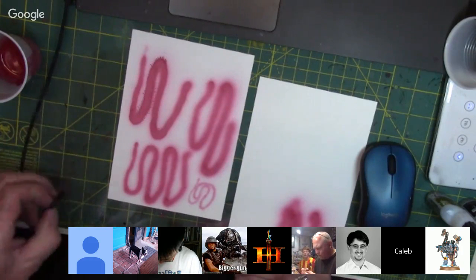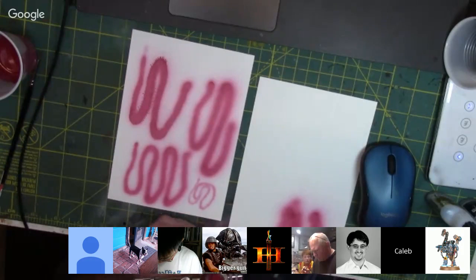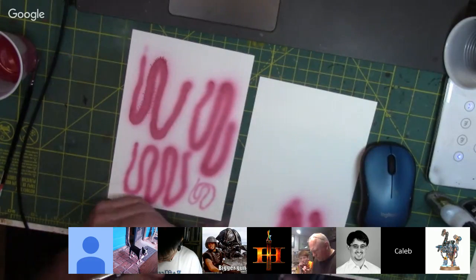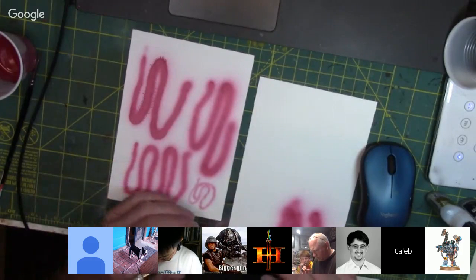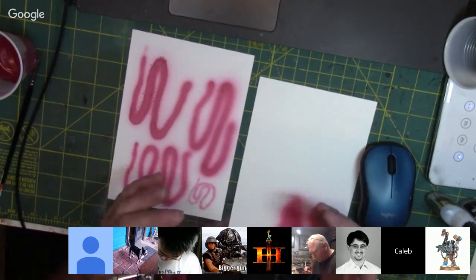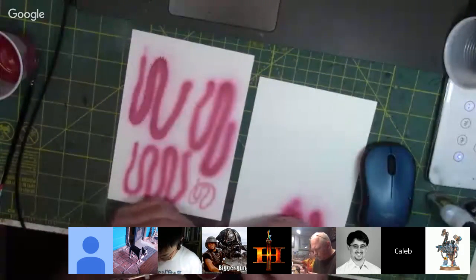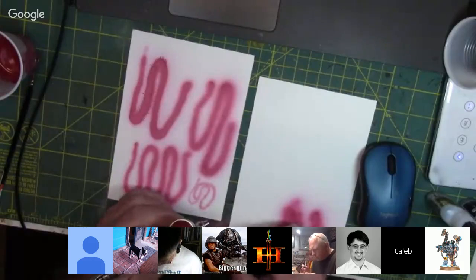I mean, in a nutshell, that's really how we're going to determine our air pressures. A good rule of thumb is start somewhere from 15 to 20 PSI. Every time that we're getting ready to paint, start somewhere in the 15 to 20 PSI, and then adjust your air pressure from there. That's the best thing to do. Don't try to start at a really low air pressure and then slowly build your way up. Try to just hold it right at that certain pressure. So that's air pressure. Pretty basic.